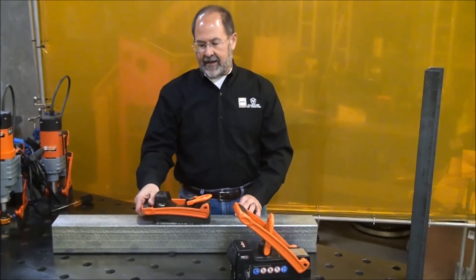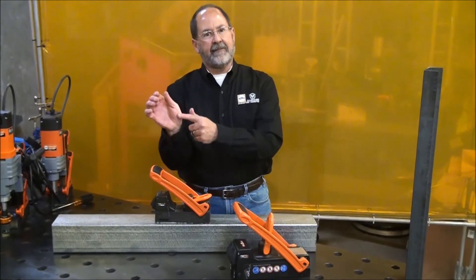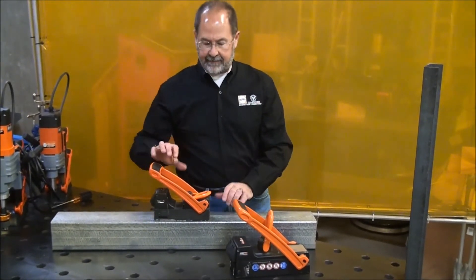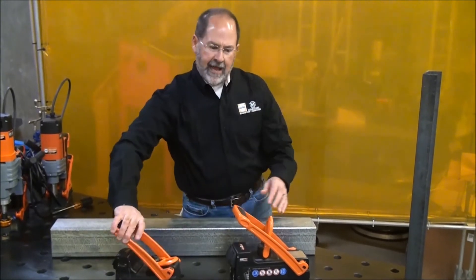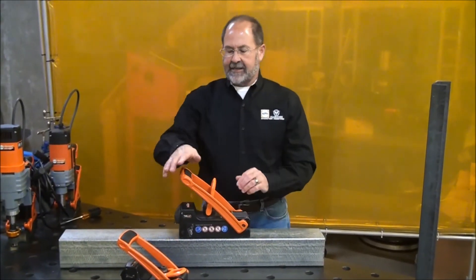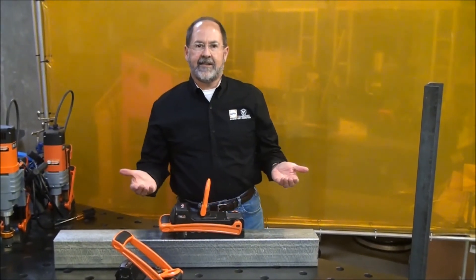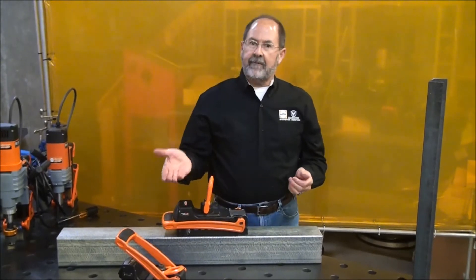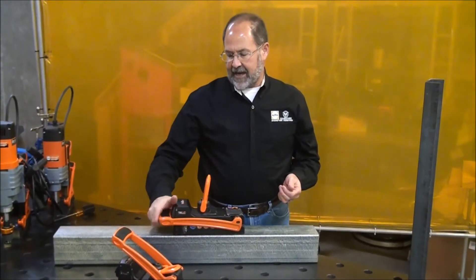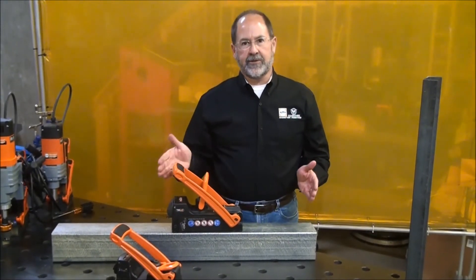When it comes back to the off position, it comes back that gently. I just use my thumb or the side of my hand to override the little safety lever we have on all of our magnets. Its bigger brother, even on 1/8-inch galvanized material, is just as easy and just as safe. Take your hands on top, give it a gentle push down — it's that easy to turn on. This one will come back a little more strongly because it's a stronger magnet, so I'll take the side of my hand and give it a gentle lift up. There's no way to get hurt turning this machine off.